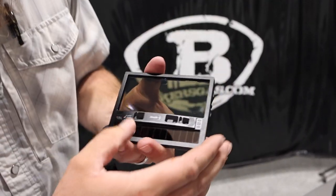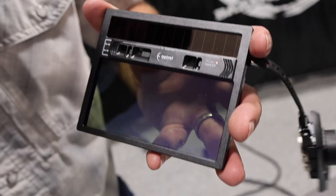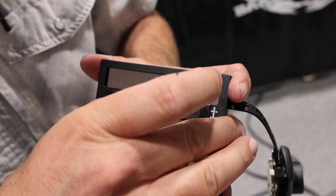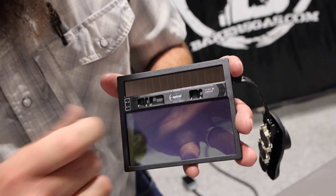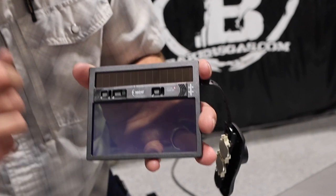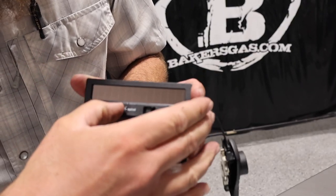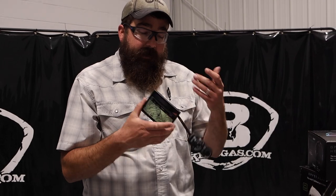On the front of the ADF — this is the Crystal 2.0 — these are the IR detection ports. You can see arrows pointing out and arrows pointing in. So if you're welding next to somebody and your helmet keeps flashing because they're welding, you can narrow the detection port. Now you've got a smaller area of detection, so it's going to pick up your weld and not your neighbor's weld. You can adjust that — I personally leave mine on the wide setting and don't have much trouble with it, though it can also be set off by sunlight.